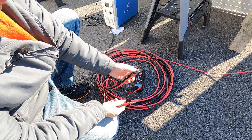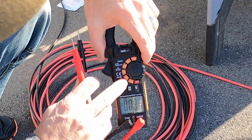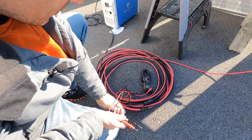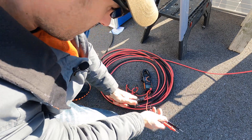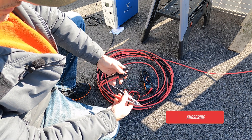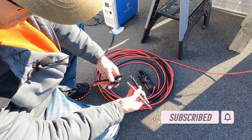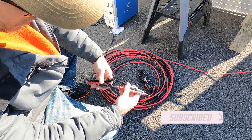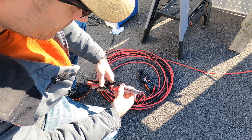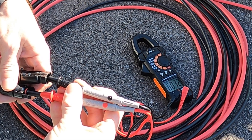I've got these all hooked up, now I'm going to check my voltage. With this multimeter, you stick it on the V set to DC. It says it's not supposed to go over 60 volts, and like I said they sent me an email saying it could go up to 68. With all these hooked together I'm going to put the positive in there - you can put these either way, it'll just show a negative if you put it backwards. It looks like it's just a hair over 60 volts, so this should be good.